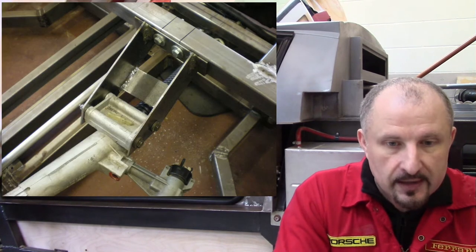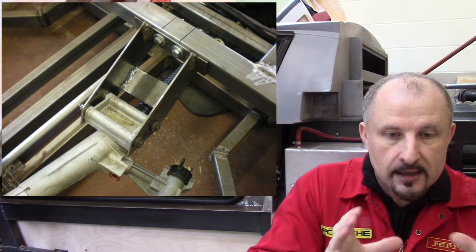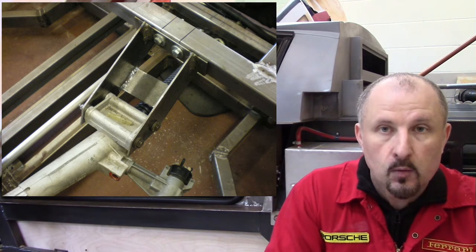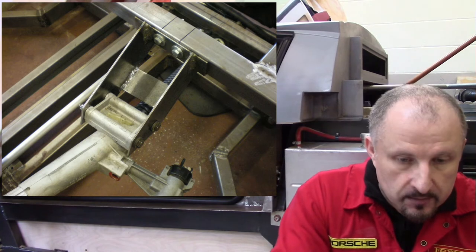There's a close-up of the bracket, and as you can see, it's slightly angled. Once I'd finished this bracket, I did a technical drawing so it could be easily replicated using water-jet technology — you just cut these plates out and weld it in a certain way. It's a very cheap and easy bracket to make.